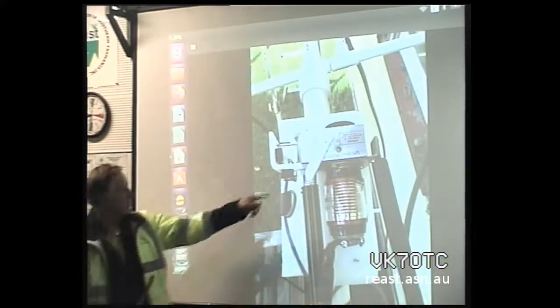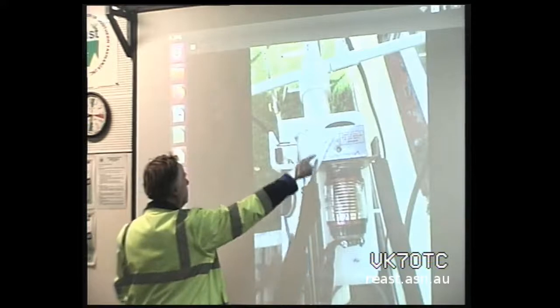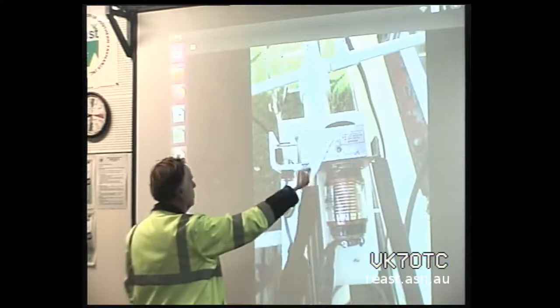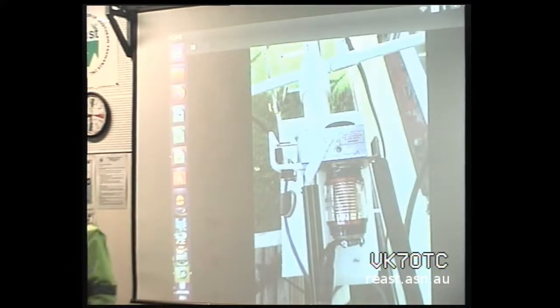Now this is the vacuum variable capacitor that I obtained at the Myanna Hamfest, probably 3 or 4 years earlier, which I hung on to. It came complete with its own gearbox and a motor. But because of the RF voltages present, I couldn't use the motor in it. So the motor was destroyed and turned into a shaft, and then this plastic pipe went outside the loop to a different tuning device, or different motor drive. That worked really well, because this little arm here was geared down so that several turns on the vacuum variable was a half turn on this. So I just had to mount some switches and I could find the end of the vacuum variable, which worked really well.